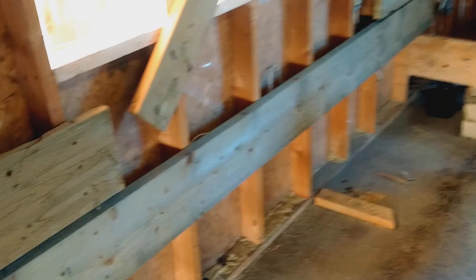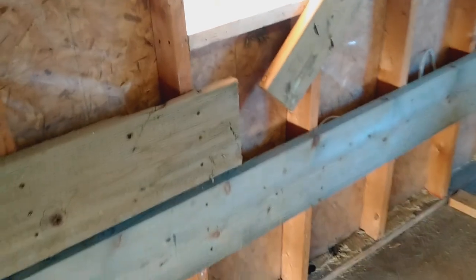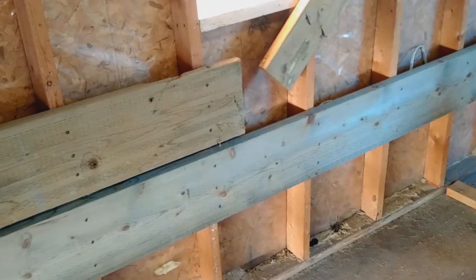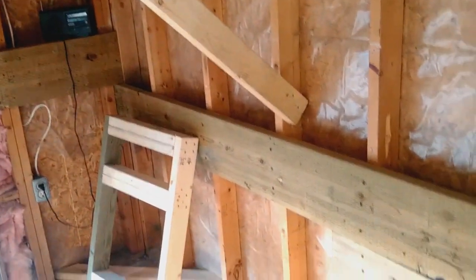I did all four corners. For the actual lifting I used 2x10s on the walls — a 16-foot board across the bottom. You'll notice it looks bent, and that's because it actually was bent. I placed a jack right there and jacked it down to pre-deflect the beam, so when it starts lifting the deflection will already be built in. The wall is longer than 16 feet, so I put another board across the top on each end, roughly centered on the lift points.